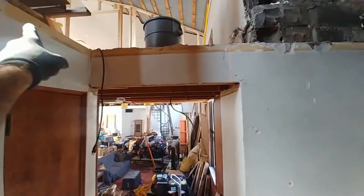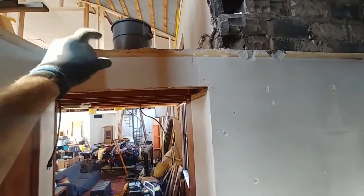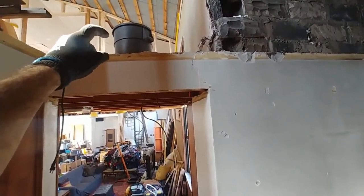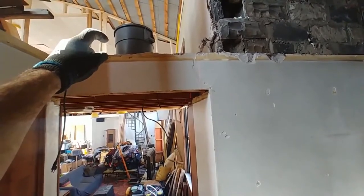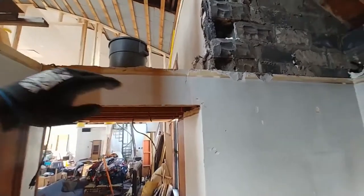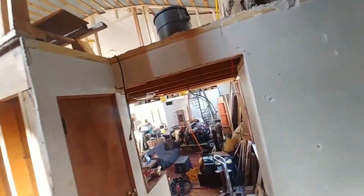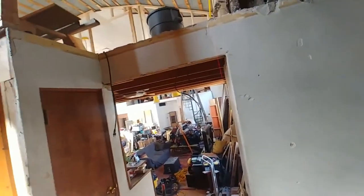Because what they did do was put 2x6 framing in, starting at that little witness point there, so it's 5.5 from there, so it was like a 4.5 or something, 4-inch step up in that room into this here, and it was like a tripping hazard. It didn't really add floor space to this room. You still need to wall that step up off, or it's just ugly. So anyway, I encouraged them to tear it out, which they did.